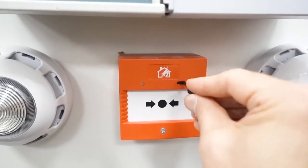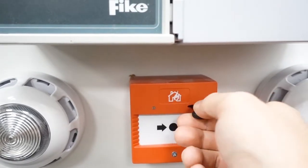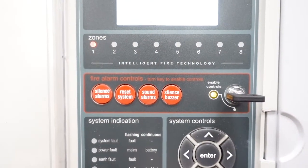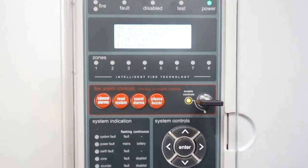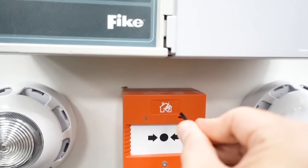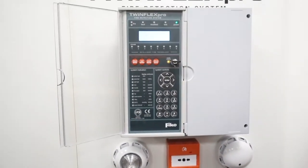So we're going to put the key in and you literally just turn it clockwise until it goes off, pull the key out, go to the panel, press silence alarm and then press reset. Nice and straightforward. Just to recap: you put the key in, you turn it clockwise, you feel it kind of click and then it will set it off, go red, and then you turn it all the way around again and pull it back out. So that's the TwinFlex system.